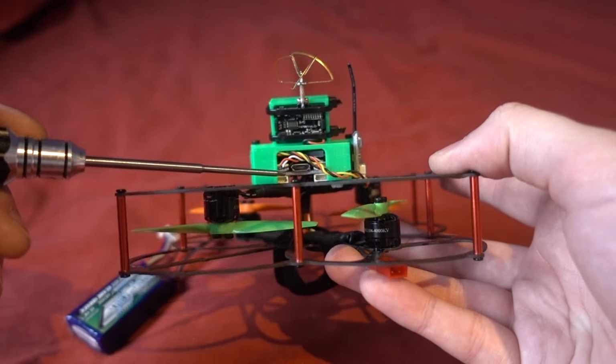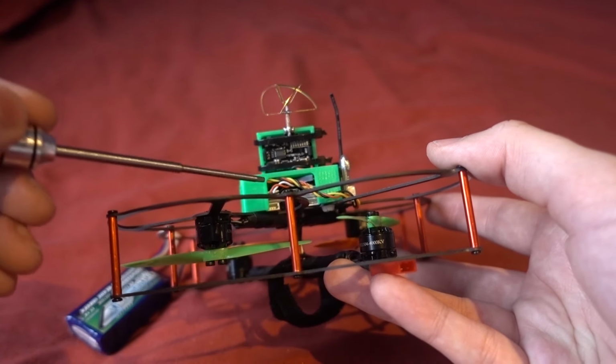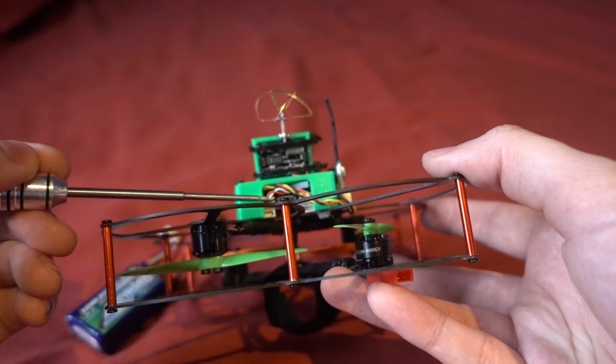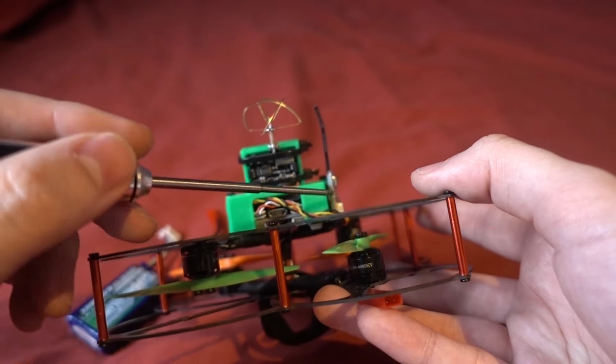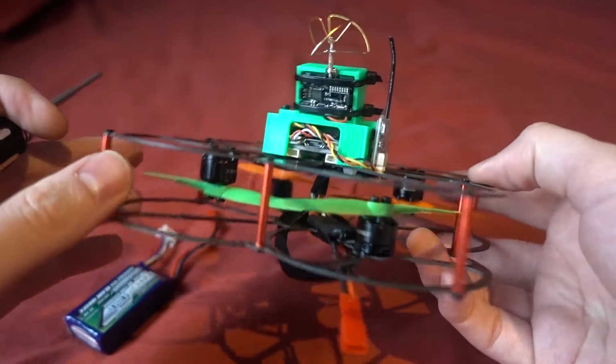I've just managed to cram everything in, so yes, it's on the UART 2 here, and then I just had to move it one along on the pin there so that I could get the S-bus working, and then that just plugs into a little Pico connector down here.